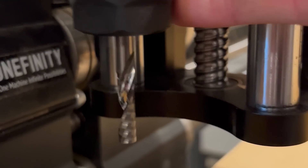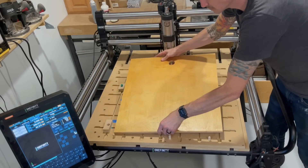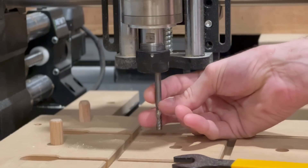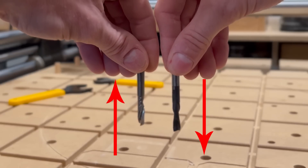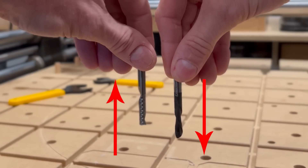I'm running the spindle at its maximum speed of 24,000 RPMs. I'm running these test cuts with a 1/4-inch upcut spiral bit on a piece of 3/4-inch thick plywood, 24 inches by 24 inches. I'm using an upcut bit for chip ejection — upcut bits pull the sawdust up and out of the cut, whereas downcut bits push the sawdust down into it, which could bog the machine down, especially once I start to get into those higher feed rates.